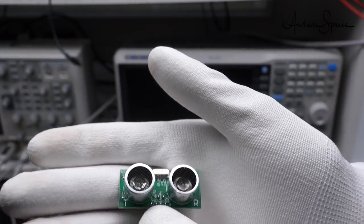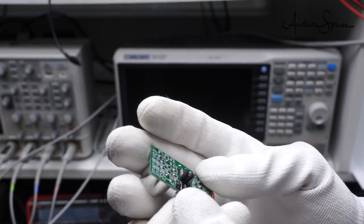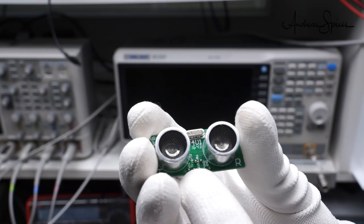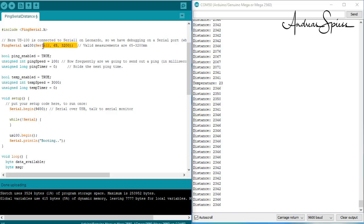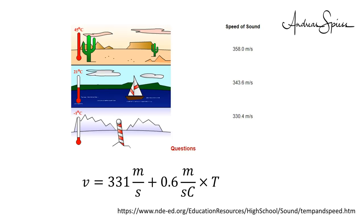The next sensor also looks very similar to the ones before. Its name is Y401 or US-100. It has only one chip but some additional features. If you remove the jumper, it behaves exactly like all other ultrasonic sensors with trigger and echo pins. But if you put the jumper in place and look at the pin labels, you see that it supports serial communication at 9600 baud. I connect it to serial 2 of the Mega and use a library called PING_SERIAL. This library triggers the sensor to measure distance — you do not need to wait for the result and can do something different with your MPU; the device takes care of the timing. And because the speed of sound depends on temperature, this sensor has a built-in temperature sensor, so you can use the actual temperature to calibrate the distance.